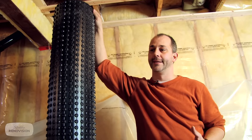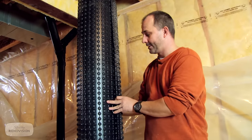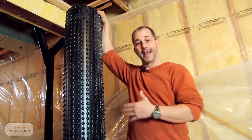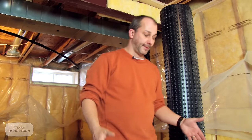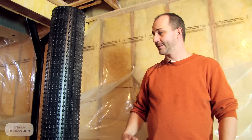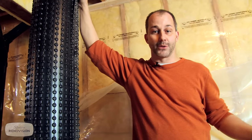There are a lot of schools of thought on how to insulate or put in a subfloor in a basement. Our basic approach is quite simple. Everybody has seen on TV shows the dimpled product used to waterproof the exterior — you can also roll it out on the floor to create a barrier between the concrete and your subfloor. Because it's six and a half feet long, you only have one joint every six and a half feet, so there are really only two tape joints in this whole room. Those joints are taped with tuck tape, making it impossible for moisture to get through into the subflooring. The subfloor we use is a chipboard tongue-and-groove true floor subfloor, five-eighths inch thick. It weaves together, then we tap-con it down and screw it into the concrete, creating a nice air space — which is an insulator — and giving us a subfloor we can put any kind of surface on, including ceramic tile or hardwood.